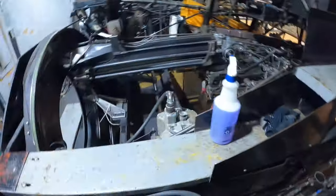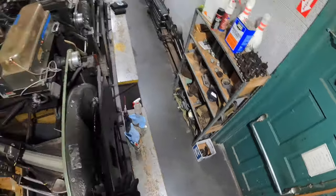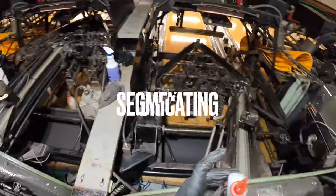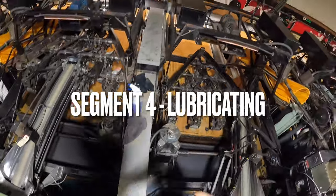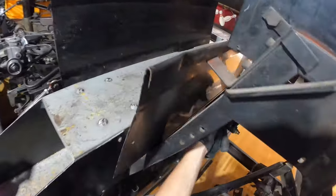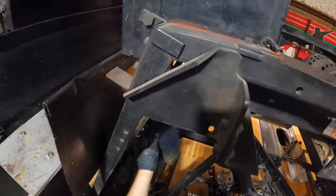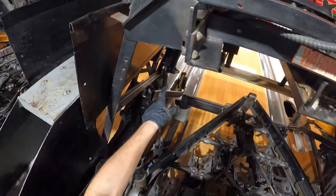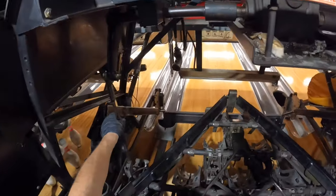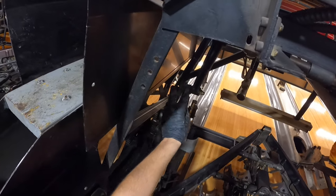While the table and everything is down, we'll get out and get the oil — I only use oil on these machines. All you've got to do, as long as you do it on a normal basis, is just give it a little wipe beforehand and give it a nice dab. I will note — you want to keep an eye on the left side table rod because it's only one rod; that side has two. Sometimes if you don't keep up with greasing this, it'll wear out and then your table will be on the pin deck, and that is not good.